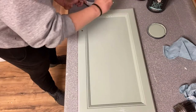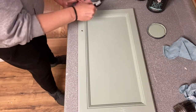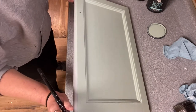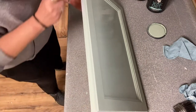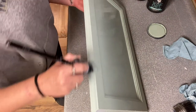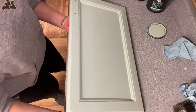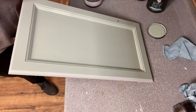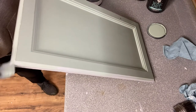The thing you do want to watch for, especially hitting corners, is drips. But that's okay — if you do get a drip on your cabinet, leave it. Don't try to pull because once this starts to dry, you'll pull and mess up the finish and the self-leveling. Remember, built-in top coat — it will start to rise to the surface. If you do get a drip, the easiest way to handle it is to grab a razor blade and just run it over the drip to shave it off.